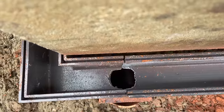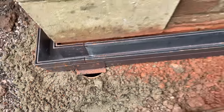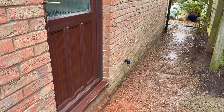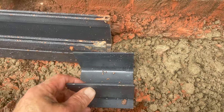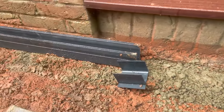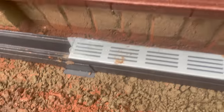What I've got to do — I've connected it up and made a little notch so the water can flow down there. This little bit here I'll just put a piece of plastic over the top so no cement falls into it. That's good, got that sorted. Now we can start moving some thresholds down there — my brother can bring some more hardcore in. For every connector on this drain we've got one of these, so that'll go half on, half off for the next one. As long as you've got about 50 mil cement underneath it, plonk them on, level it up, tap it down — jobs are good. I just put the little connector on there; literally pick that up, put that on top, nice and flush.